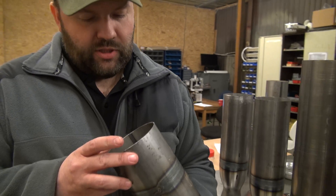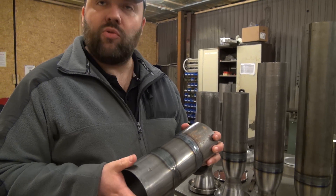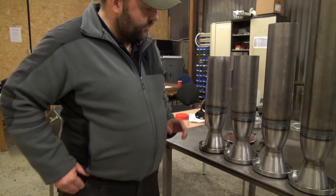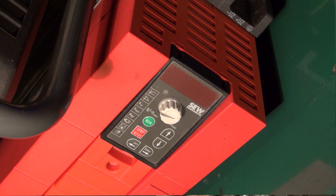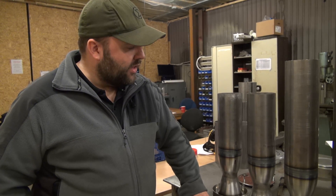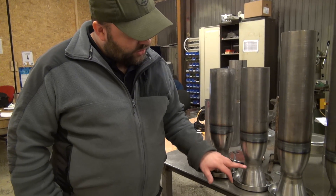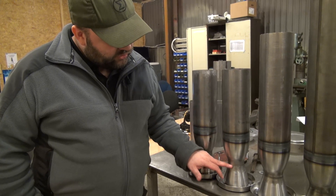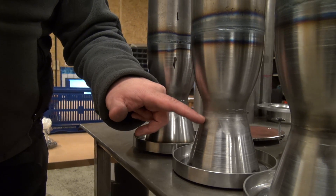After building up our confidence on this test piece, we decided to take it one step further and try on one of these actual engine parts. What we did first was modify our old lathe with a frequency drive — one that can make the motor spin very, very slowly. It takes about a minute to make an entire revolution on the lathe, which is about the welding speed we need for these parts. The diverging part and the convergent part were manufactured as two separate pieces.